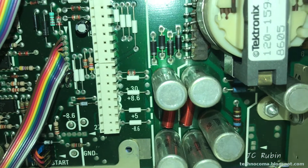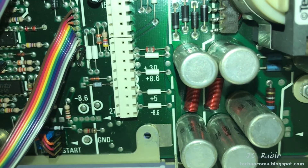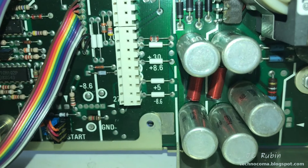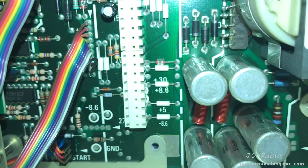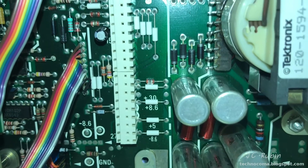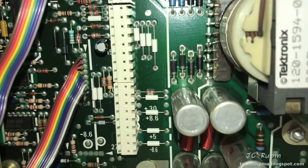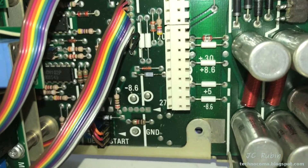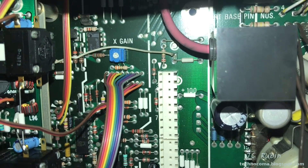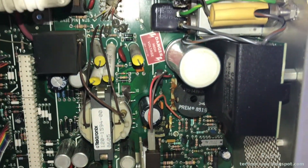Following the book, we'll look at DC power, which is probably one of the fundamental tests of this unit. You can see right off the bat where the cage comes down the white line — we can see the voltages right after what looks like possibly diodes or some sort of protection. You can see the negative 86, the 5, the positive 86, the 30, and I think there's 100 up there. The test points are there. We're going to start our test regiment after I assemble this high voltage box — I'm not going to be working around the flyback if I don't have to. The only adjustment needed from within the restricted area has the pot situated sideways so it can be done from the side of the chassis — there is no need to be in this unit when it's energized.